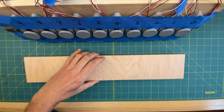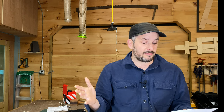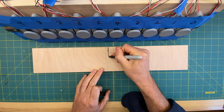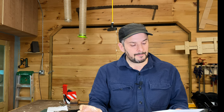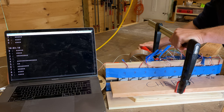I don't want to rebuild the whole device, but I can make the boards narrower and move the clamp toward one side or the other to see how that affects things. The next set of boards I checked were 90 millimeters — a little over three inches. I checked in three places: right in the center, and also at measuring spots two and seven. At some point the number three sensor crapped out, but I think I can still get a good sense of what's happening — some forces that would have gone to that spot went into adjacent spots, causing some spiking.